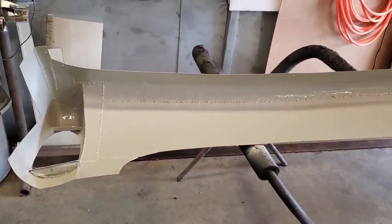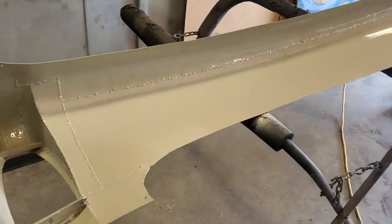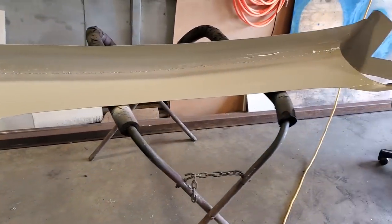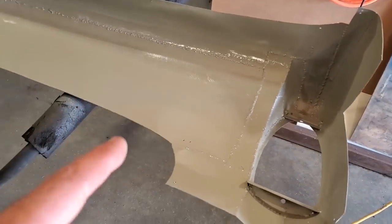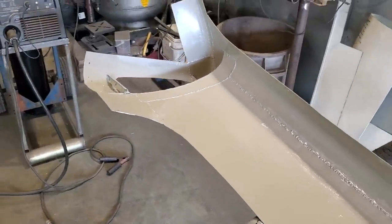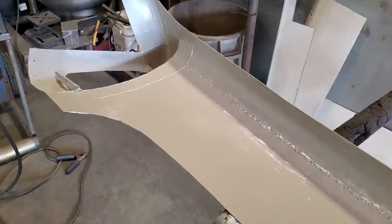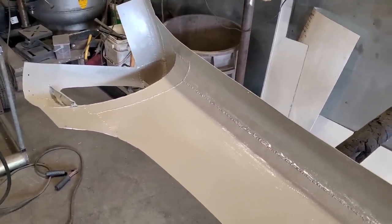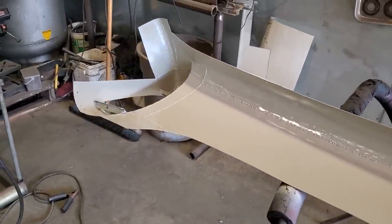You know, in cars down the road. It was only this past weekend I was out looking at a car that I restored back in 2012, and the car looks the same as what it did when I left my shop. So there's something to be said about looking after the vehicle when it's done. If you're restoring a car, welding pieces in it and all that type of stuff, there's going to be places on the car where you're going to have bare metal on the back side of it. Don't get so hung up on it. If you're keeping this car for a long time and you're keeping it in a dry environment, you will be fine. It's only when you actually take the car and put snow tires on it and drive it for winter and don't look after it that you're going to start running into problems.